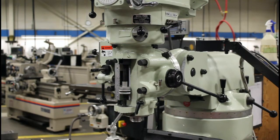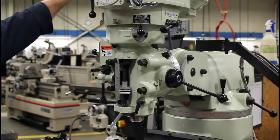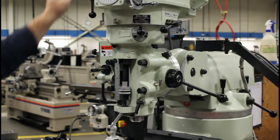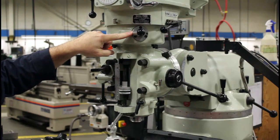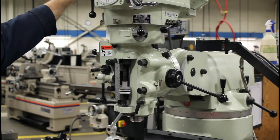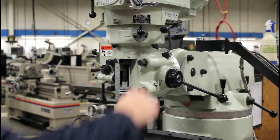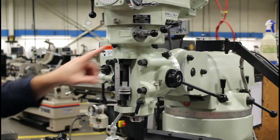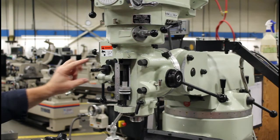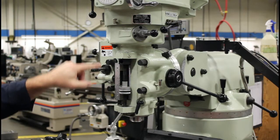We want to power feed down. So the first thing we're going to do is turn the machine on, and we see that this is in the off position. So what we need to do is stop the machine and put this into the on position. So now when this is turned on, this is disengaged, but when I engage this, this thing will start turning.